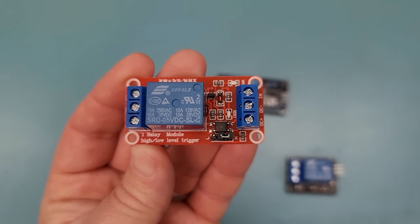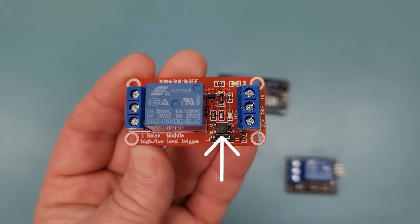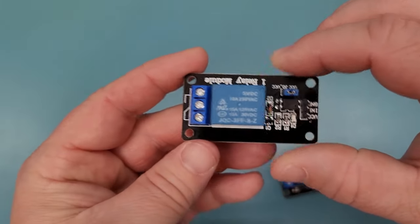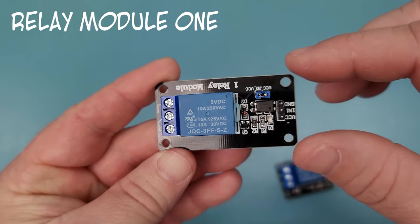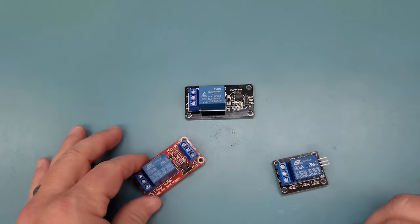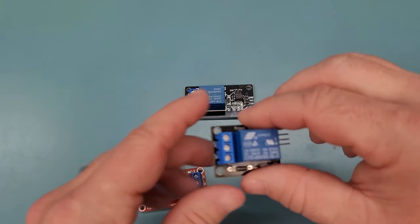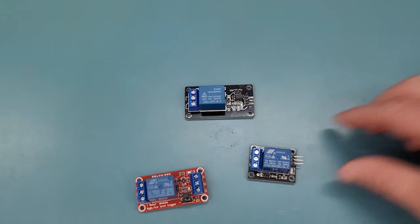To the right of our relay, we see the control circuitry. This includes the main transistor, a protection diode, an optocoupler, and control input pins. Here we'll be able to connect our microcontroller as the control circuit and provide the voltage potential to power the relay. There are also a couple of LEDs to indicate that the module has power and when the module is activated. A unique feature of the first module is the ability to switch between two voltage sources by moving the VCC and JDVCC jumper. The second module has the feature to select between using a high or low input to activate the relay. The third module has a bit more bare bones, lacking features such as an optocoupler or voltage control jumpers.